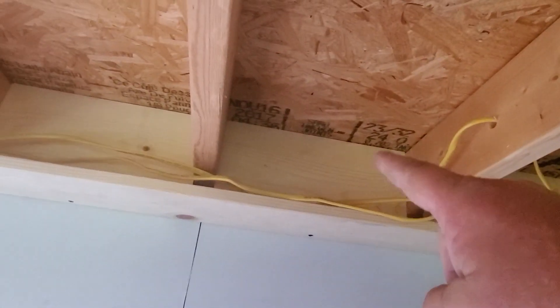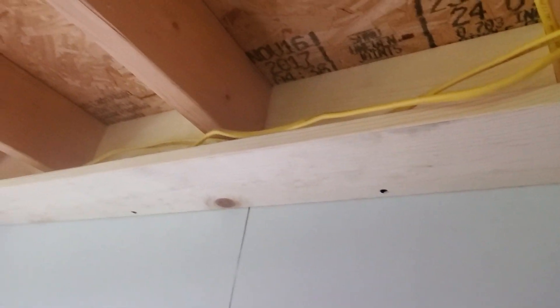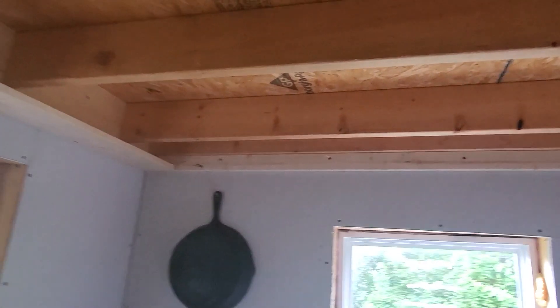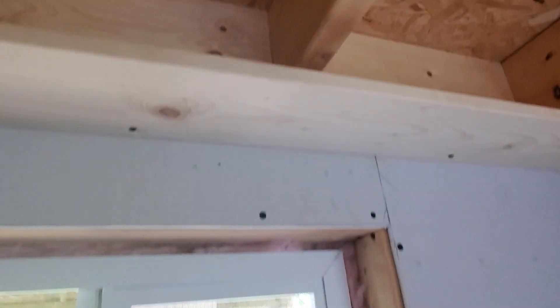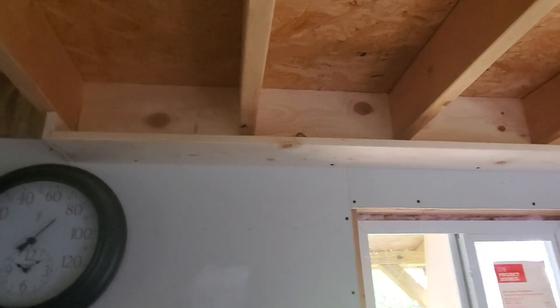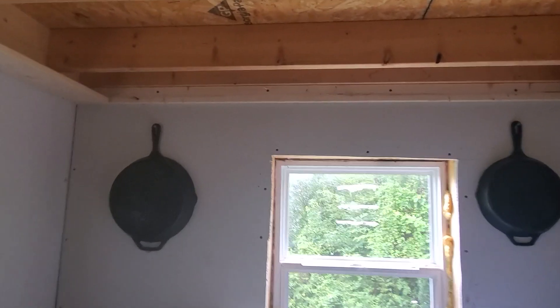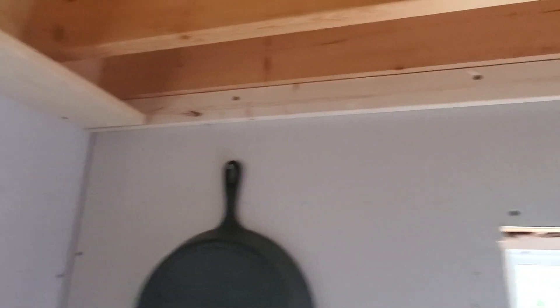The 1x8s hung down a couple of inches since these are 2x6s, and I had some 1x6s that I screwed up into the bottom of this — and voila! Space is a premium in a little house or cabin like this. Look at this — I have all this 8-inch shelving now that is out of the way and not interfering with anything. All that extra storage! Then I ran a 1x3 across there just for looks to trim it out, and it comes right to the bottom of the 1x6 — that's perfect.